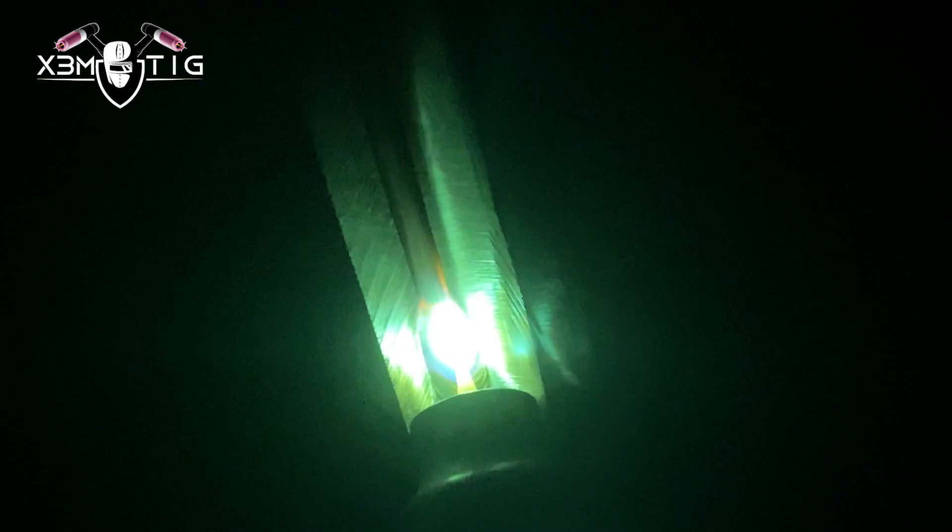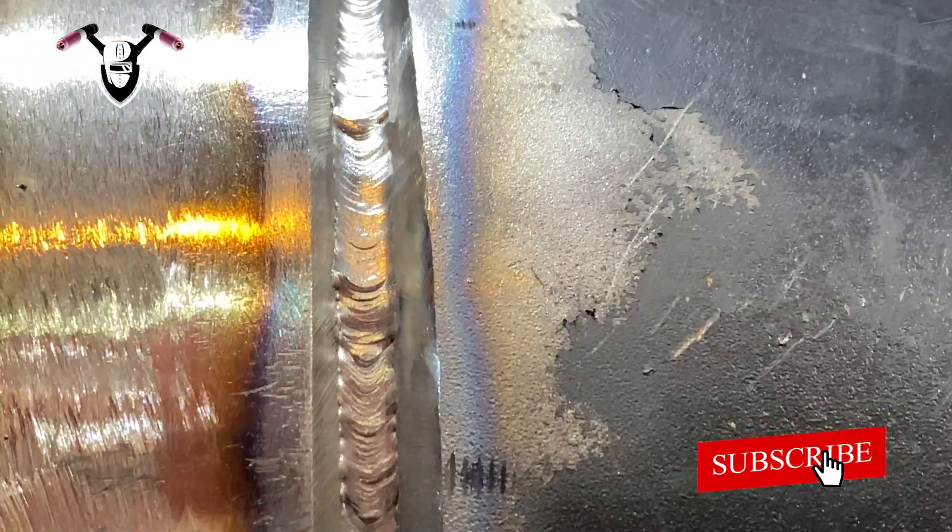You can always grind your stop/starts — that's a really good habit. For the lay-wire technique on the sides, keep the wire 50/50 inside the bevel. When going up the sides, don't go too slow or you'll get excessive root build-up. Travel speed, feeding speed, and gap size all play a role — there are a lot of factors. The root pass is the most important pass.